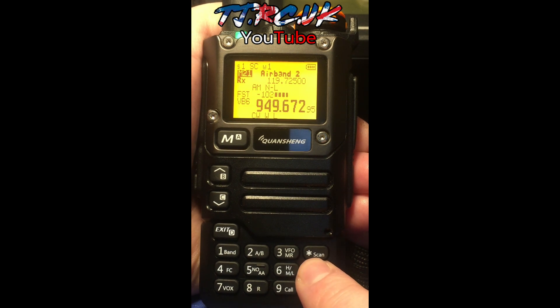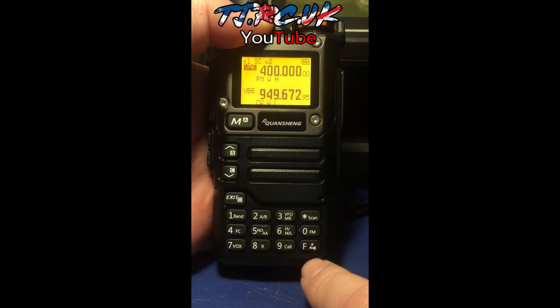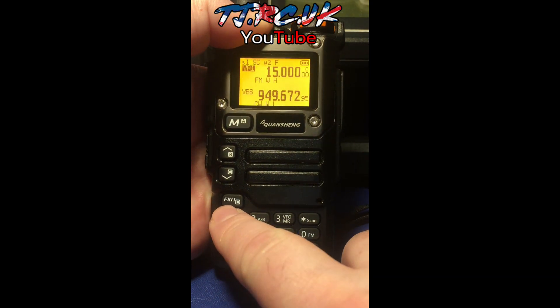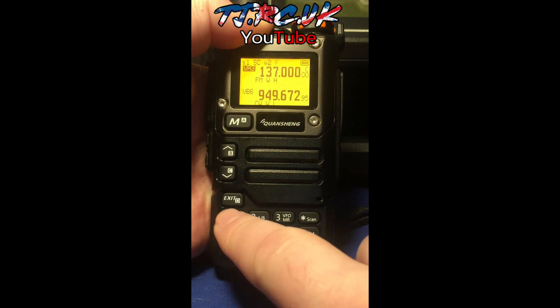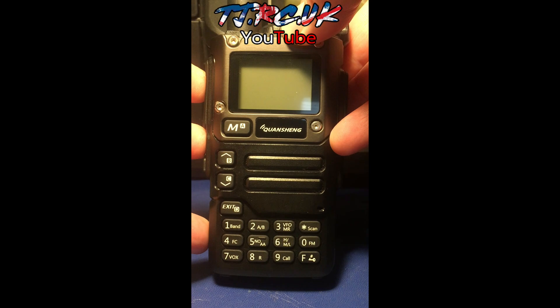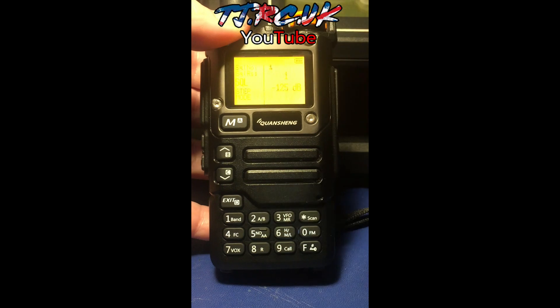You've got your modulation straight from the keypad — zero FM, just press and hold it and you cycle through SSB, CW, FM, AM. In Egzumer, to go through the frequency bands you just press and hold one; from IJV it's F1 — you can see it changing the frequency bands. To go into the hidden menu it's PTT and F1 on switch-on, then release the keys.